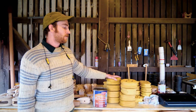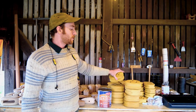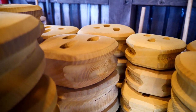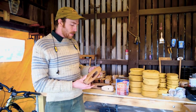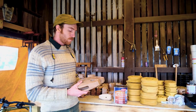All of the deadeyes are Osage. These have a consistent load applied to them — they're going to be tensioned with the shrouds, so they take the place of a turnbuckle or another more modern tensioning system. It's fantastic wood. We have very little live oak — literally only two blocks in the regular live oak.